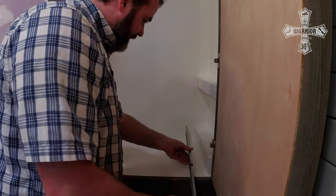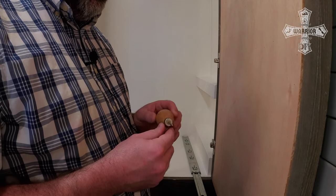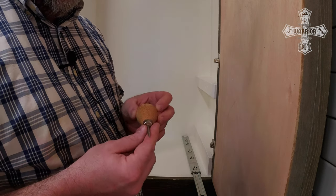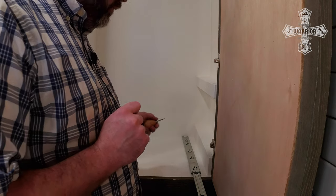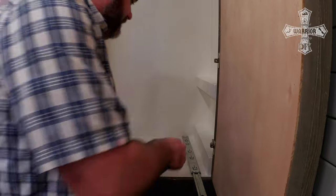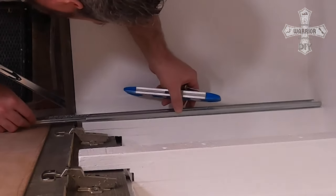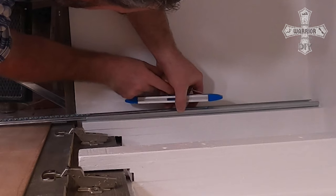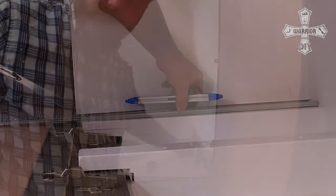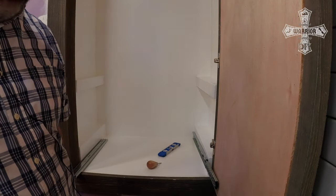What I do is install the wall piece here. I've noticed that the screws that come with drawer slides are kind of frustrating to work with. I use an awl or ice pick — something with a sharp point — to poke a starting hole where I want to put the screw on the drawer slide. By doing this it gives you that starting feature, almost like pre-drilling, so I'll set one at the height I want and go ahead and poke that hole in there.